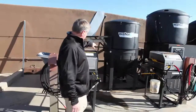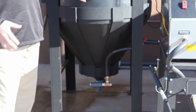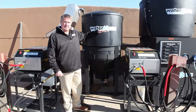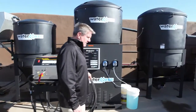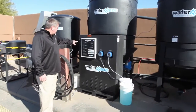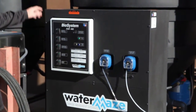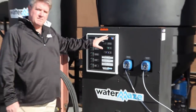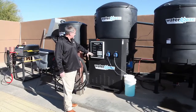The first tank is a cone-bottom tank. Every one of them has got a very nice cone-bottom slant, so you've got a lot of separation. There's no channeling like in some of the older systems. All of these basically auto-purge for maintenance and service. The controlling module in a recycling system for a biological system with Water Maze is called the CLB 603. You've got all your pump switches, your microbe and nutrient pumps. It's a larger cone-bottom tank with all your pumps, floats, transfer pump, sump pump, and ozone pump all in this particular system — really a nice setup.